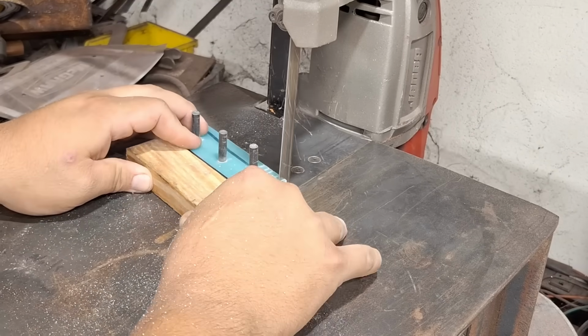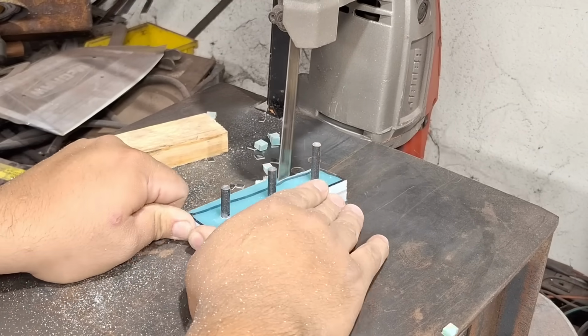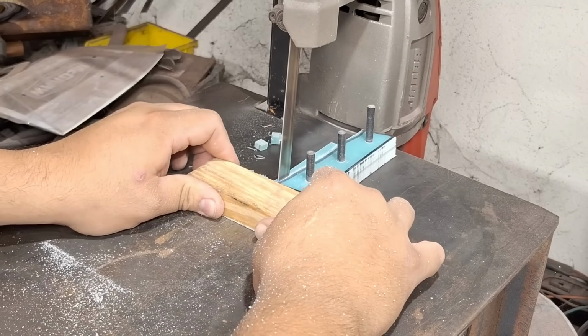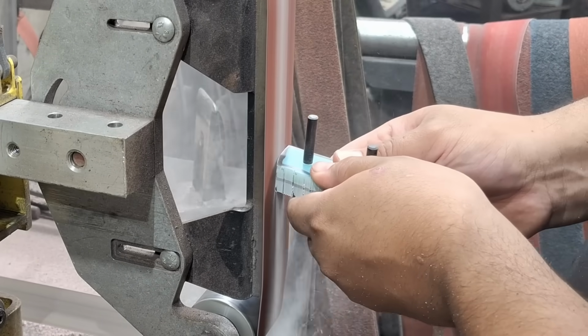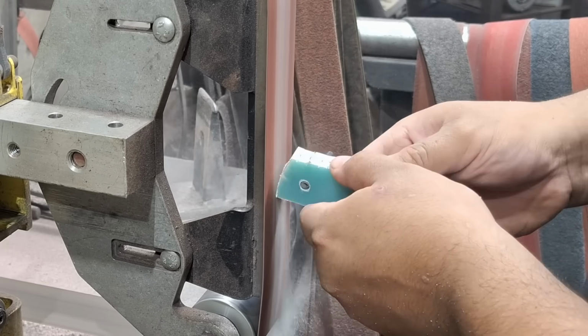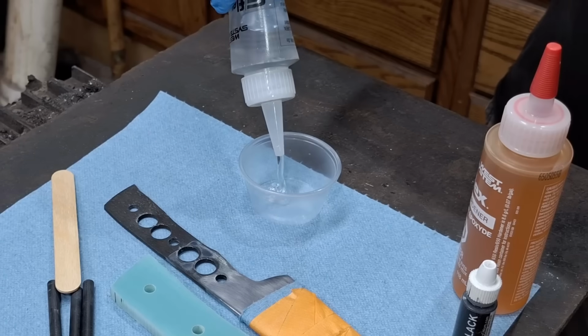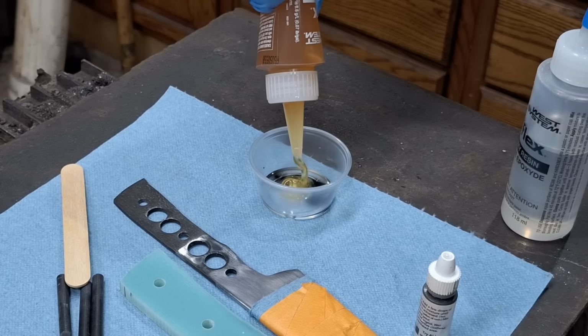And they're a very pretty shade of teal, bluish green. And I figured, well, this is kind of like a fillet knife and fish hooks, so a blue theme would be nice. This stuff is very powdery though. It grinds very easily and it's very soft on the grinder. So definitely use some good respiration and PPE whenever you're using it, because this stuff is very, very dusty.